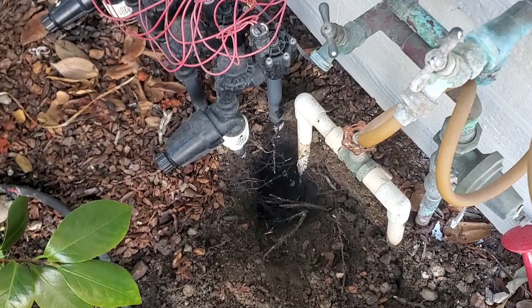On the first job, the folks called because they had their property water turned off since they had a sprinkler valve stuck on and their sprinkler system shutoff valve wouldn't shut off. When I got there I found that the gate valve handle just spun, which meant that the guts had broken inside, so the only remedy was to replace the shutoff valve.